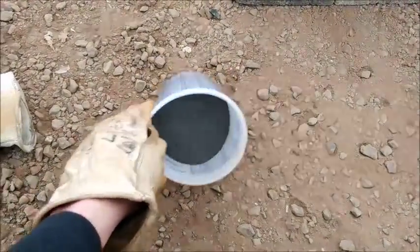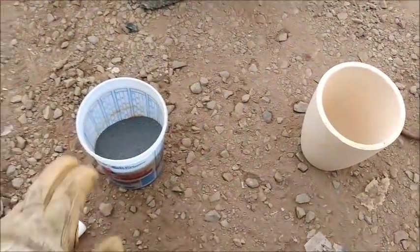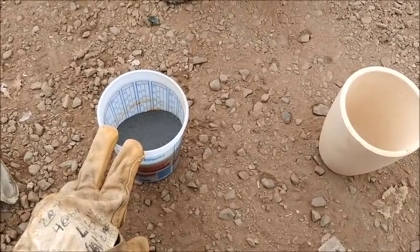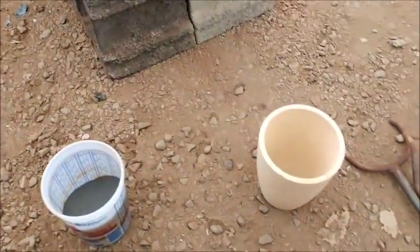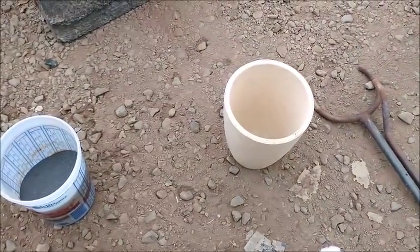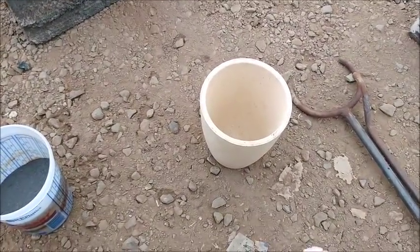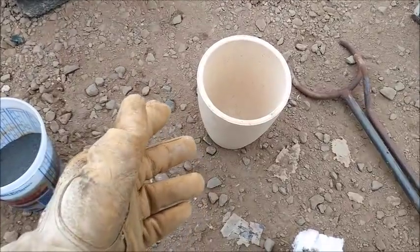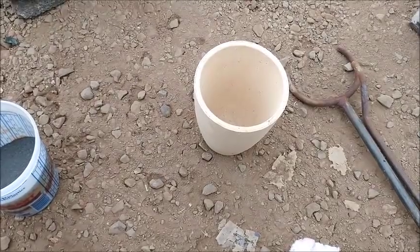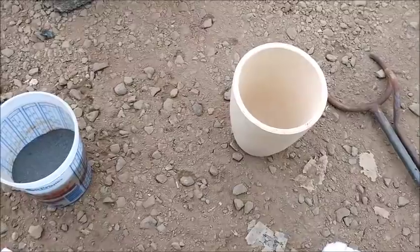Here's the material we're going to be experimenting with. This is some high grade concentrates off the shaker table. On all of the charges, I'm going to be adding metallic iron in the form of, I think I'm going to use, a piece of steel flat bar, and I stick it right down the top of the furnace into the crucible. That way the iron will reduce any of the other metallic components, lead, copper, into metallic form, and they will precipitate hopefully down through the slag and collect in the bottom as metallic metal, either in the collector metal that we use or as a button if we don't use any collector metal.